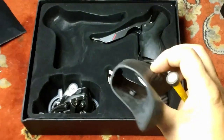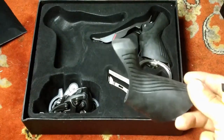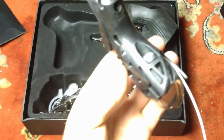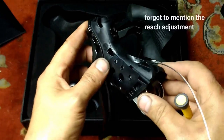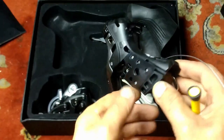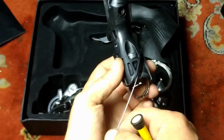The hoods are of quite reasonable quality — I was afraid from the photos that they wouldn't be this nice, but they're pretty decent. Of course, the question remains whether we'll ever be able to obtain spares. Under the hood it's got SRAM written all over it — the way this cover forms the edge of the brake cable groove there, it's pure SRAM. We've got a couple of directions for the gear cable: outside of the bars and the inside.